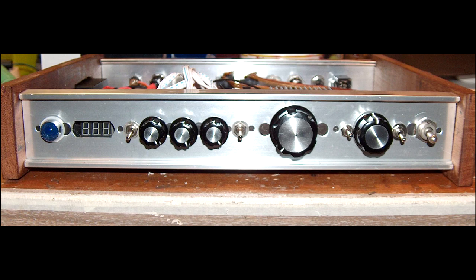To test the power on this thing, because we're running off batteries, first we would set the master rotary switch at the noon position where we see it now, and we would hit that toggle switch to the left of it down — that would tell me my input power. The input power is two 12-volt batteries running at 24 volts, or a master lithium-ion bank. You can see behind the amp on the left there's a black box — that's one of the sealed lead acid batteries with a big white sticker on the left side of it. If we had two of those running, it would be about 25 or 26 volts. As the day goes on they drain a little bit — say we've been playing for 12 hours, really cranking it out, powering a lot of speakers. It would be down even as low as 21 volts, and that would be reflected by setting that knob to the noon position and pushing the toggle down. The triple readout on the left will tell me the exact voltage coming in on those batteries.